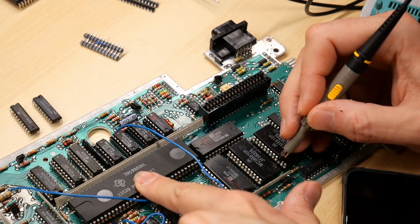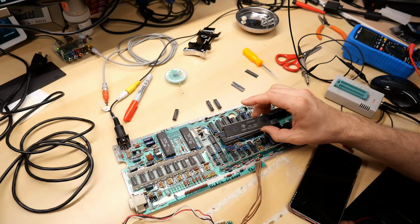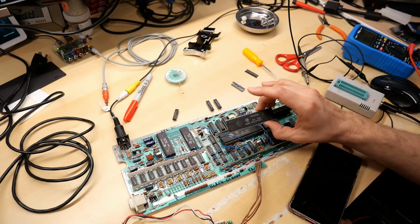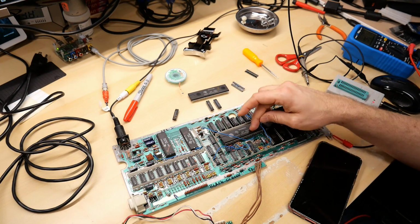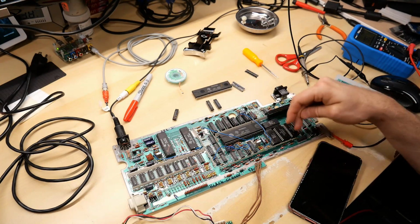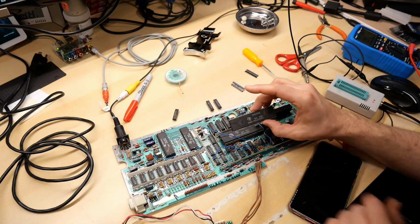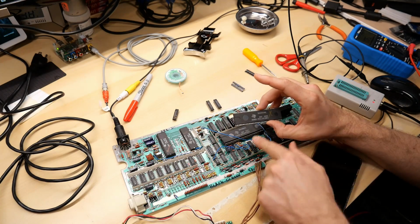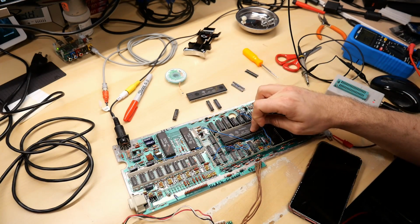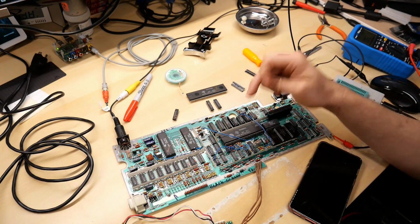and I really think that's coming from the CPU, which I have damaged. I did go ahead and put the original CPU, the one I took out of this board, back in here just to see if it looked like the same problems when I originally had this chip in there. And absolutely, all the data bus lines and everything just went back to looking very screwed up and not working. So this CPU definitely is bad. And this CPU, I'm pretty sure worked perfectly, except I ruined that one data bus line.